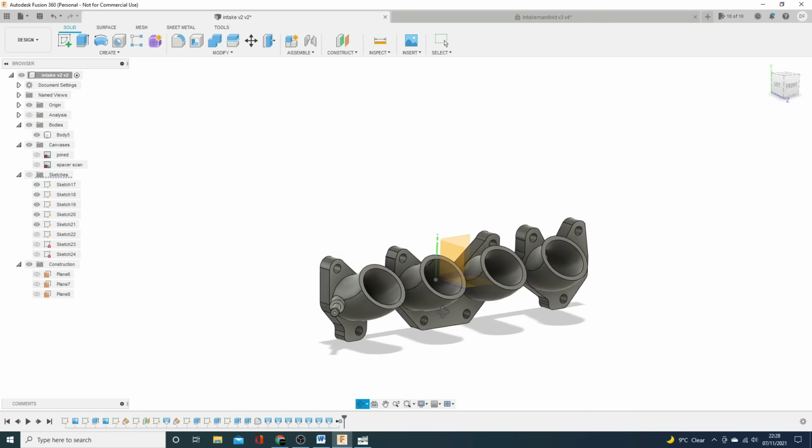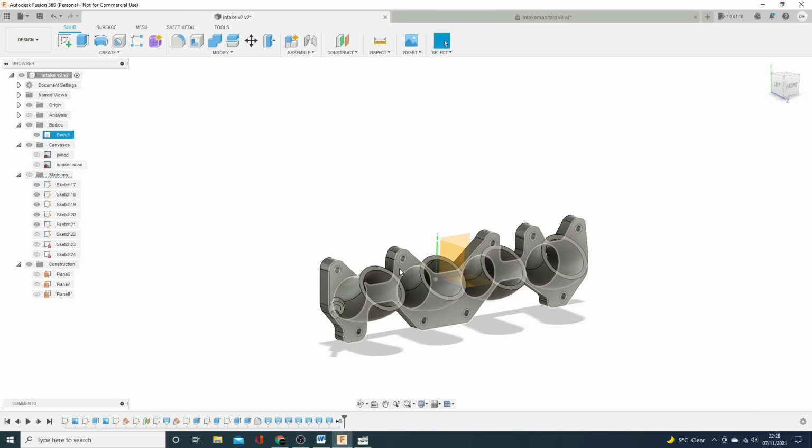I do have an issue, which is that these runners as they stand are too thick to get over the rubber coupler. Now, I made them that thick, 5mm, because I want them to be strong and I also want them to be thick enough so they hold vacuum. But they're too thick. They're too much OD. So I need an extension that comes off there that's only 3mm wall that allows me to get my urethane, my silicone hoses over. And that'll also give me a nice kind of edge there, a shoulder I can butt up my hoses against.